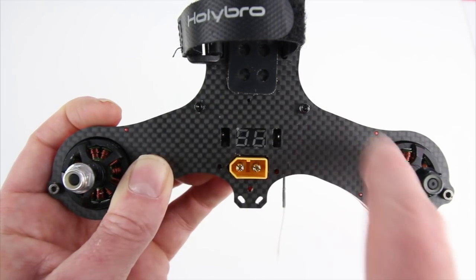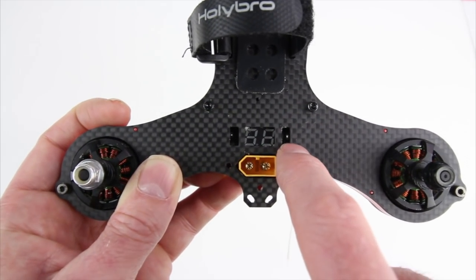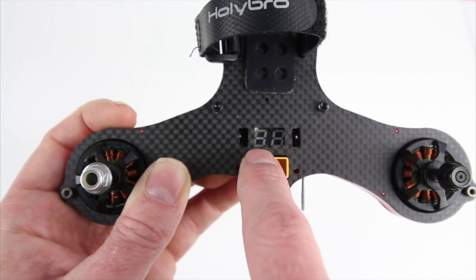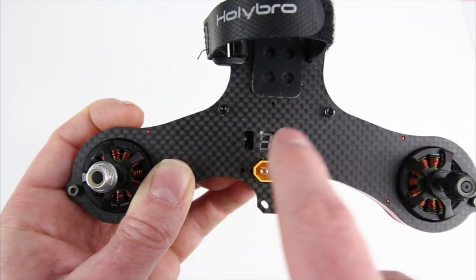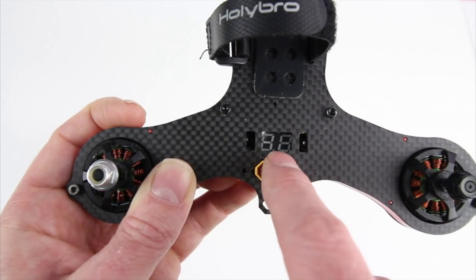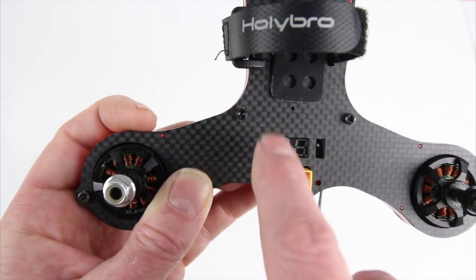This is the rear of the quad — there's a little tiny VTX channel button inside; stick a driver in there and press it once to change the channel. The channel display is on the right-hand side and the band is on the left. When I plugged this quad in it was on the IRC channel by default. Long-press that button to change the band — if you want to fly on Raceband, you can do that. Unlike the older Shuriken 180, this side does not have a button, just a hole for some reason.